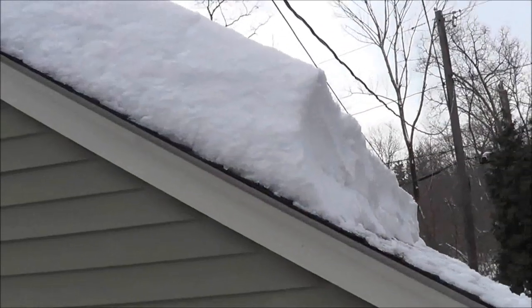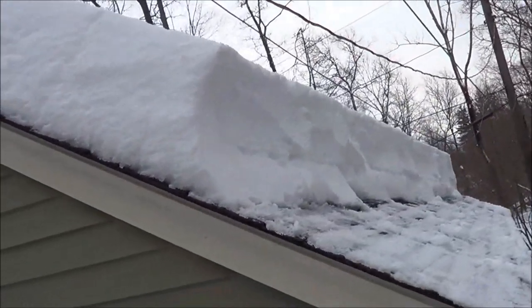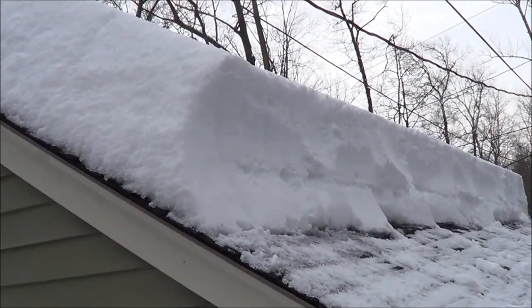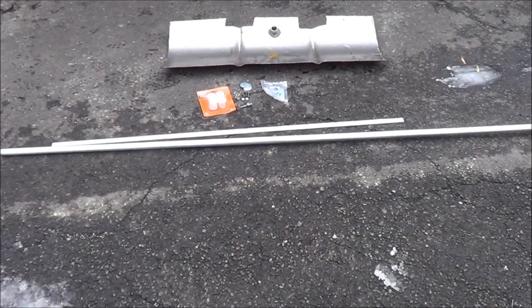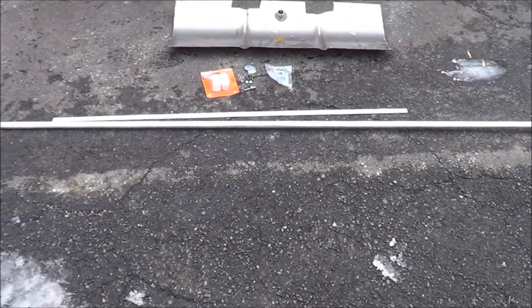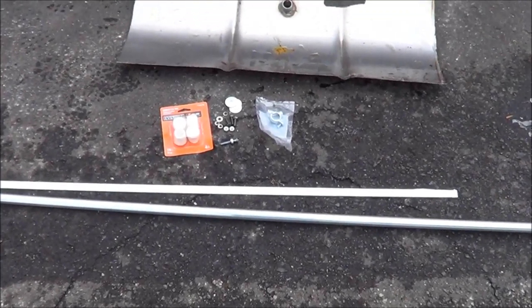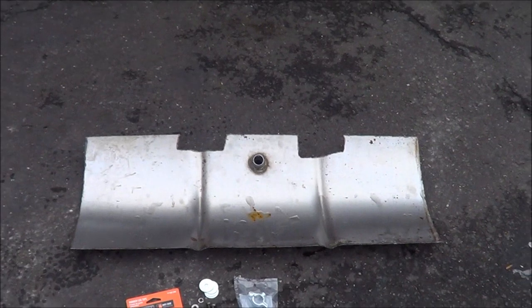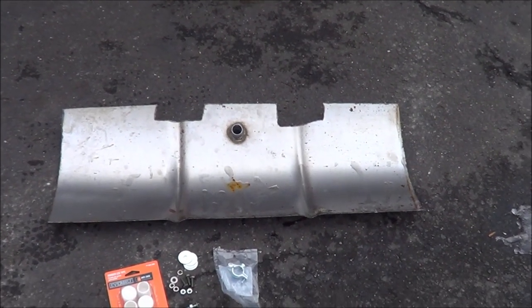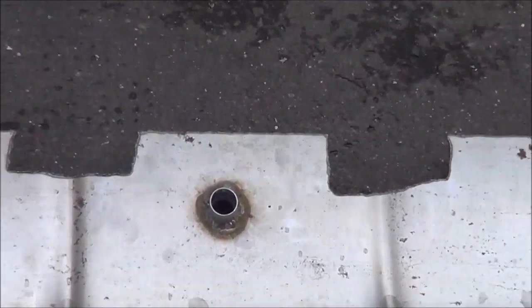You can see how thick that snow is. There's a layer of ice — if you look you can see that line, that's actually like a half inch layer of ice from the storm we had like a week ago. Anyhow, what I have here is a ten foot length of three quarter inch EMT pipe, a four foot piece of three quarter by eighth inch flat stock, some rubber bumpers, some hardware, a clamp, and the scoop — that's a piece cut out of an oil drum, and I've already welded the connector on here that will connect the pipe to that.